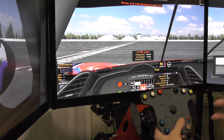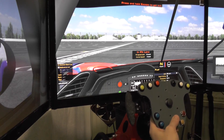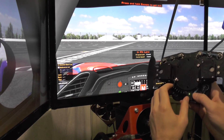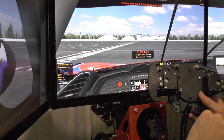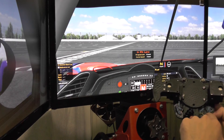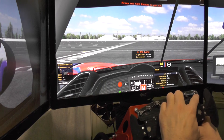The way you want to configure the buttons is all up to you. I've been testing this for probably a month now and it's working really well — no issues with the shifters. One thing I did notice, and you should definitely keep in mind when you build this unit: I'm using rather thin hookup wire — don't do that. The forces in the OSW are quite high and I've had, especially down here, a ground pin break. Once the ground pin breaks, since they're all hooked up with one ground, both buttons stop working. This is why I've secured every single connection with hot glue.